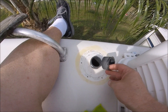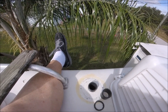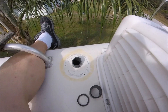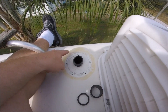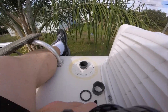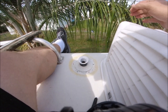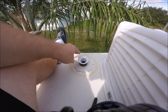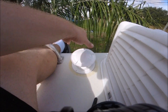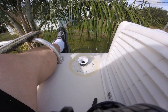So I cut down the PVC pipe stack to the right size. I had a couple of go-rounds with it because I wanted this to fit flush, and now it does — it's nice and flush. And what I realized is I'm going to go ahead and seal up the old screws because the new siphon isn't going to fit into those screws. This is supposed to fit right in here nice and tightly. You want to be careful though not to loosen the pipe down below in the black water tank, so you need to stabilize that pretty nicely. This fits beautifully right in there and I believe it's got a nice seal in there.